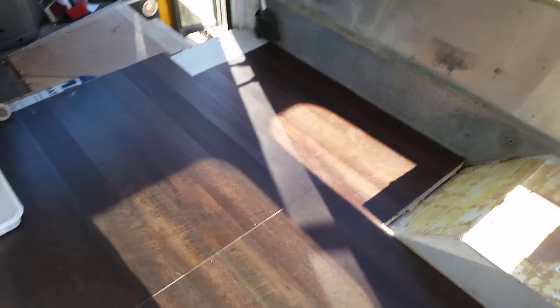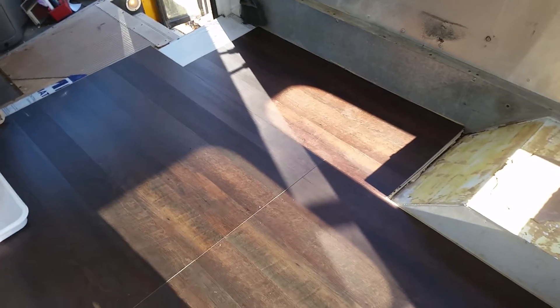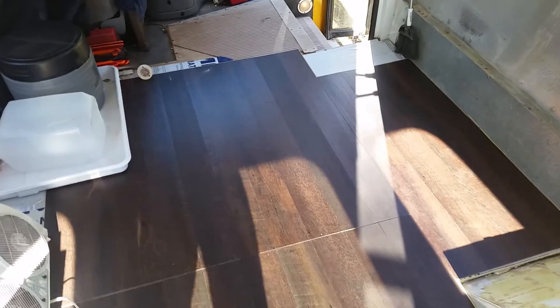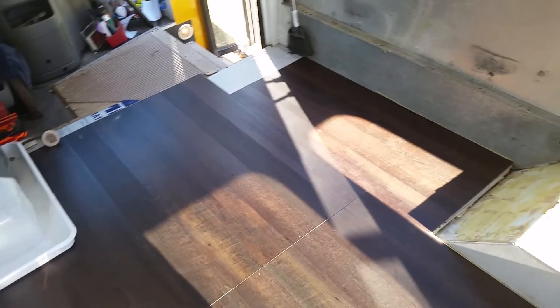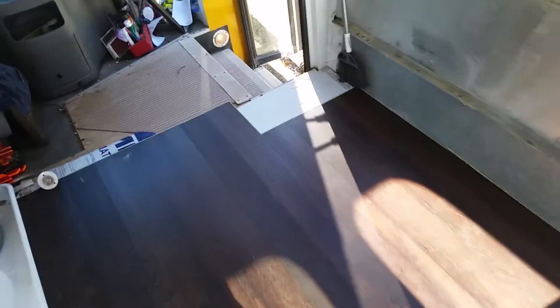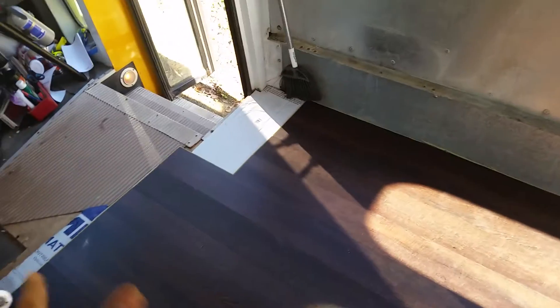I like the way the vinyl plank came out — plywood underneath, then insulation, then the vinyl plank. I know it's supposed to be the other way around, but the wood underneath wasn't rotted and I'm not going to take up that plywood and redo it. I even put insulation down, which I wasn't originally going to do — I was just going to put vinyl on top of the plywood — but I decided to do somewhat of the right thing and put insulation down.